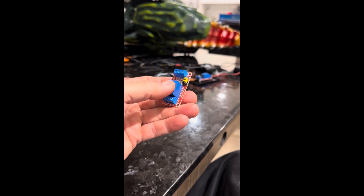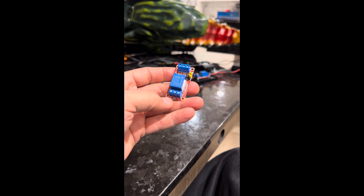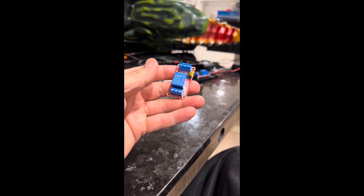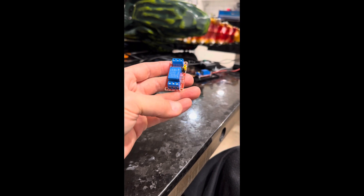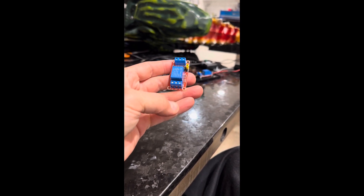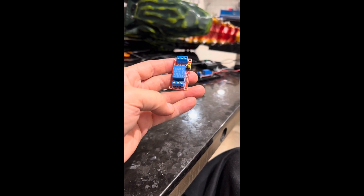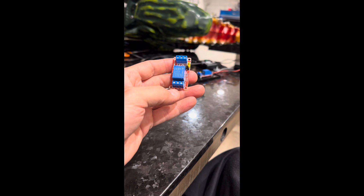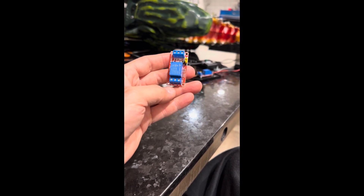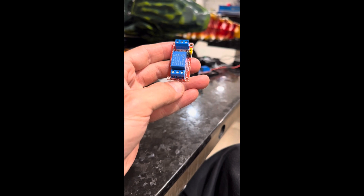So you want to come out of here — you're going to run four wires: two going to your prop and another two going to your fog machine, if you want to run both at the same time. If you're only running one prop, then obviously just run two wires — one from the normally open right over here and one from the common.